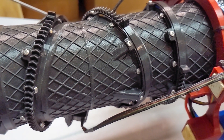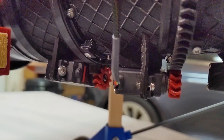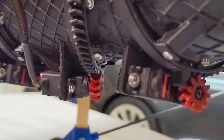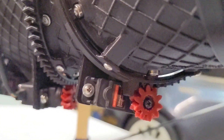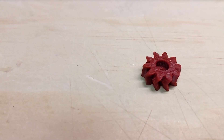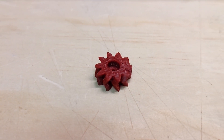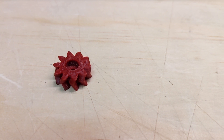I'm really happy with that. They're also the double helical herringbone style gears — not for any particular reason, but they look kind of cool and they help keep the sections in plane. What I found out while doing this, which I thought was really cool, is that I can actually print pinion gears with fine enough detail on the servo spline that they'll properly engage the servo and not need any extra work to keep them from sliding around on the servo shaft. They engage really nicely and are really secure.